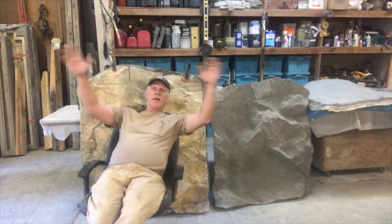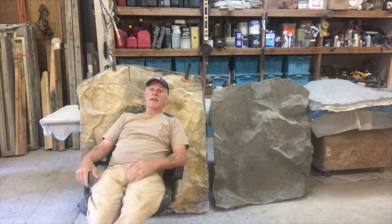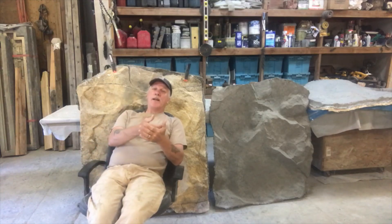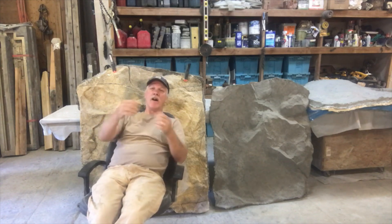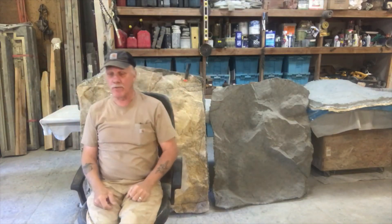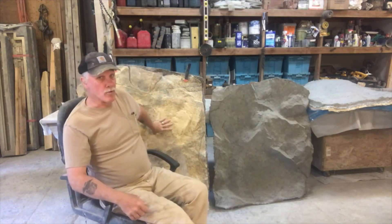If you and I walked upon two rocks that were once together, we wouldn't even know they had been partners. They're both positive — they both look like rock. My sons tried it on a small four-square-foot rock panel mold first, successfully. Then we went to engage a big one and had a problem: we weren't releasing the prototype with enough release agent. They used two forklifts, put holes in the molds trying to pull the rubber apart, and we ended up ruining the new mold.